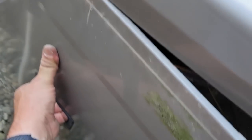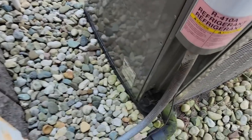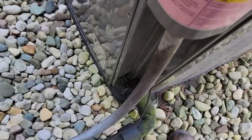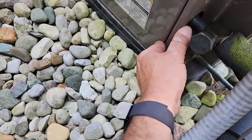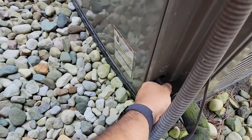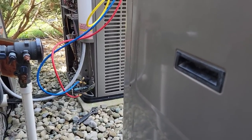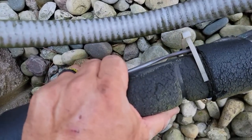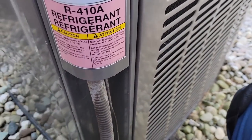Got the cover back on the contactor. Got the high-end covers back on - it's a little bit better, still doesn't want to fit very well, kind of bow-legged. Oil looks clean but I'm feeling a lot of heat pumping out of this thing. The suction line's coming back nice and cold. I think it's probably dirty. You can feel the liquid line - it is hot, definitely hot. So there's obviously a coil here that's dirty. This is going to be washed out.